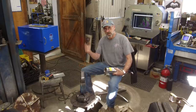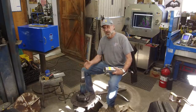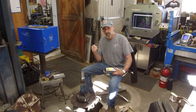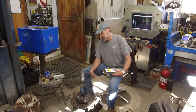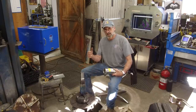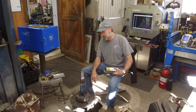Annealing we did. Annealing is controlling the cool down to change from hard to softer. And normalizing is just letting it cool down at room temperature. So there are basically two differences there. By going to normalizing, you're not quenching it or anything else, so you're not going to go into the hardened state.